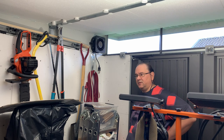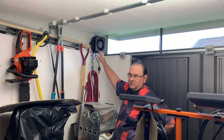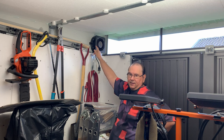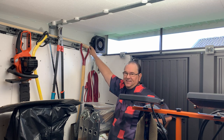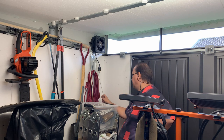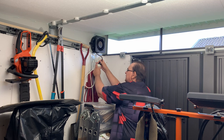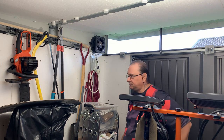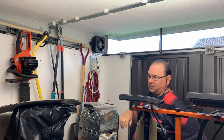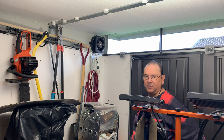There's still a period where I have to turn the servers off, but I think this was really good. I didn't make a video about how to install this — it's very unique to this specific location. I had to 3D-print holding brackets because this is a fan designed for an attic, meant to go through a thick insulated wall, but here it's just one-millimeter sheet metal. Now it's on manual control, so I plug it in, and it has quite good airflow. Running for hours it exhausts quite a lot of extra heat — you can feel it from the outside, the air temperature is much higher than ambient. So it's doing its job.